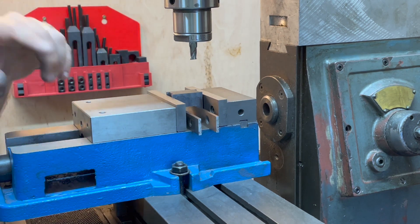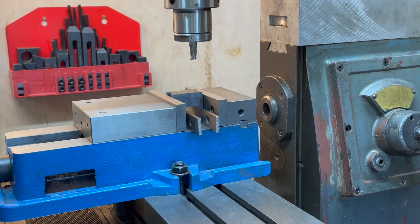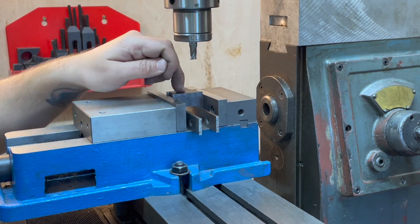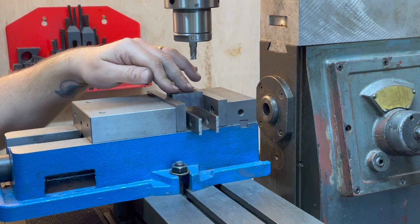If you remember I had some problems when I was using the horizontal milling cutter when I was slotting them - it was getting hot and it wasn't cutting very well. So this way I will just shave off the top surface to bring them all exactly to the right datum point.